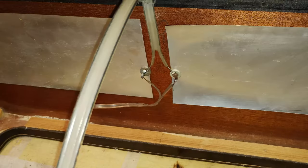It is also appropriate to remove the internal antenna wire. It is important to observe that the two original screws have washer spacers for making contact with the aluminum foil that makes the internal dipole, and also to avoid penetrating too deeply and passing through the thin wood.